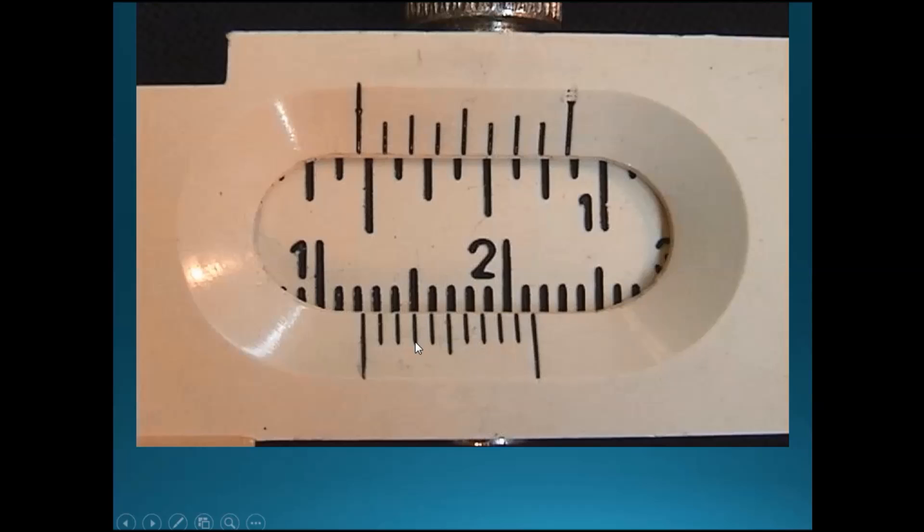Since this bar is the best matching point, we count from the front: 0, 1, 2, 3, 4, 5, 6, 7, 8, 9, 10. This bar falls at position 3. Therefore, the correct number to add to your previous macro reading is 3 — the micro reading will be 3. To remind you, our macro reading was 1.2 cm.